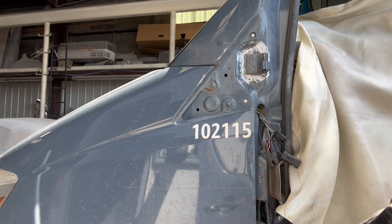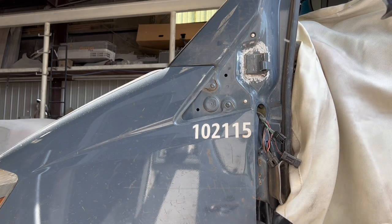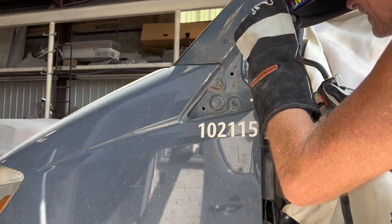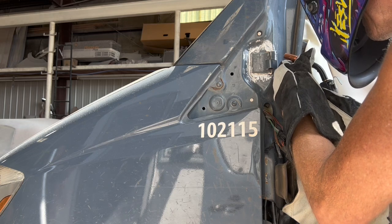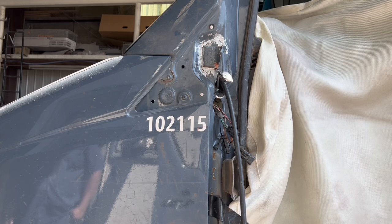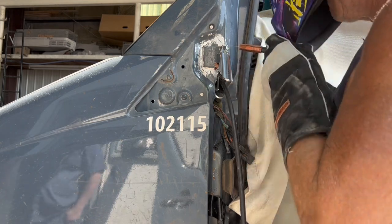I truly appreciate the gloves since I usually get my fingers pretty hot sometimes with my thin gloves that I normally wear. I'm having trouble seeing the wire because the sun is shining in from behind me and into my hood — I can't see on my old welding helmet. I have a flap that goes across the back to keep light from coming in from the back side. It took me a minute to figure out why I wasn't getting an arc — I changed my polarity on my ground cable and now I'm ready to weld.